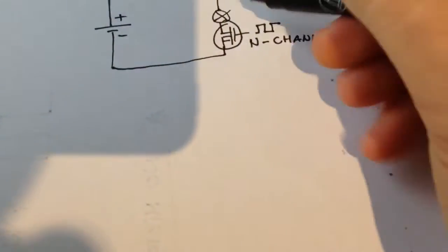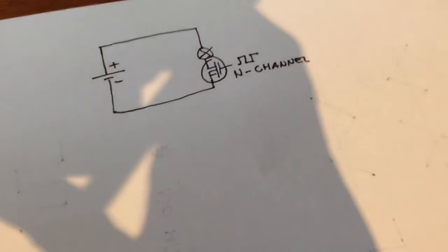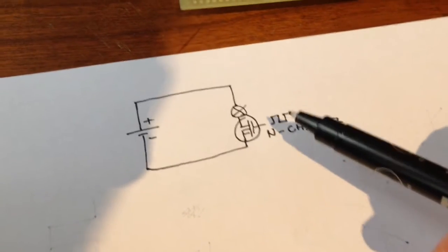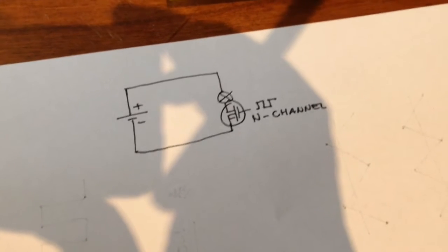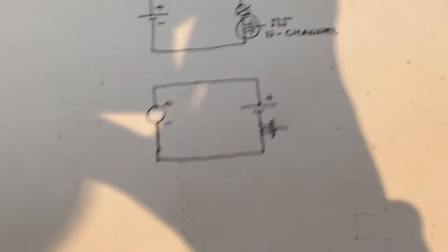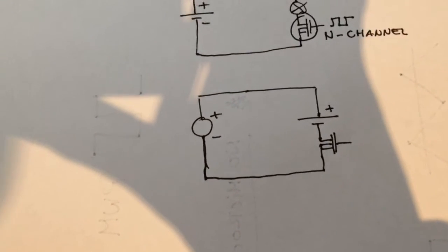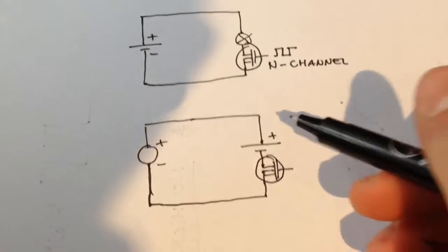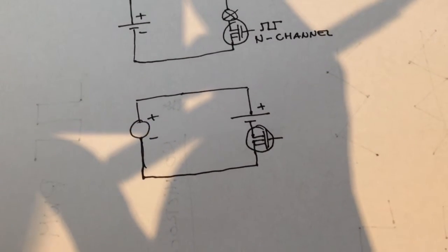Let's say we want to control the brightness of a lamp — feeding a PWM signal into the gate of a MOSFET would certainly work for a lamp. But the situation with a 12-volt battery and a solar panel is slightly different. Here's the same circuit but instead of a lamp we're using a solar panel and a battery, with an N-channel enhancement-mode MOSFET on the low side. In theory this should work, but there's a very important component issue.